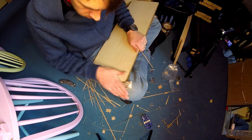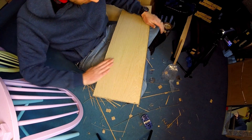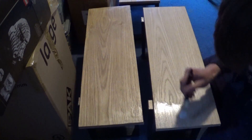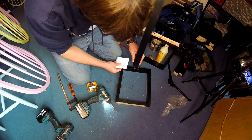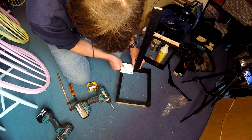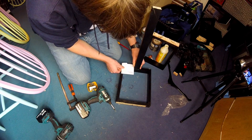I was thinking that if you had a good solid really sharp block plane, it might be great just to rip along the face and take a little bit more off before you come around with the blade. But after the Stanley knife, some sandpaper smoothed the edges down and made them look better — I'm kind of too lazy to go for my block plane. Once this was all done, I went for three coats of clear varnish to give it some protection, sanding between each coat, which always makes it look a lot better.